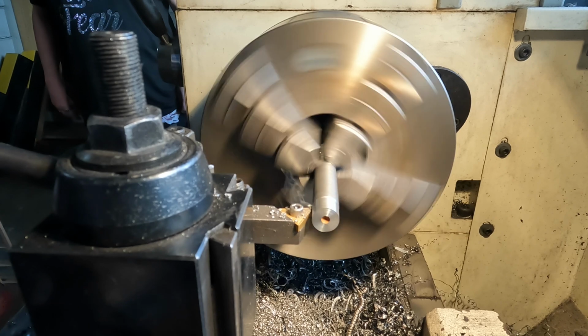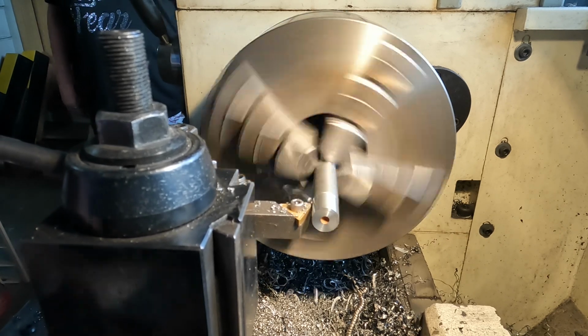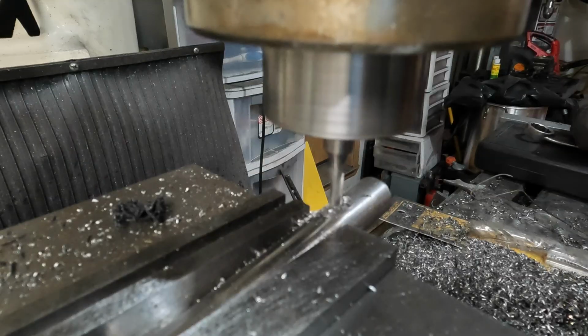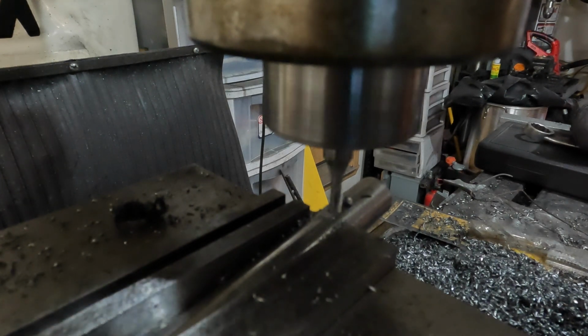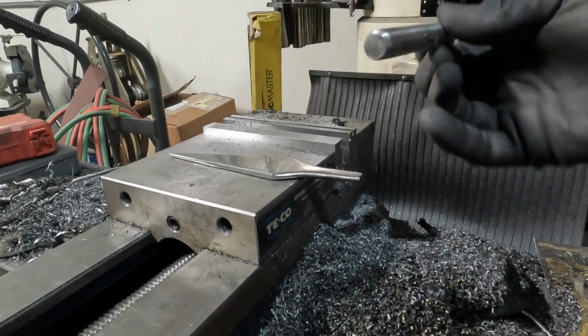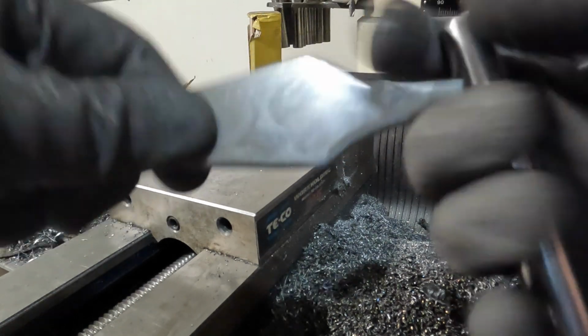And so I'm going to cut that off after I forged that out and drew that out to approximately, it was about 3/4 of an inch in diameter. Then after it's drawn, cut, separated, I'm machining it in my lathe and getting that diameter very consistent, cutting a nice finish on that. Then I'm going to throw it in my mill and I'm going to mill a slot here using a very small ball cutter.